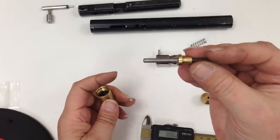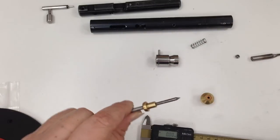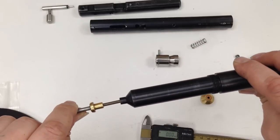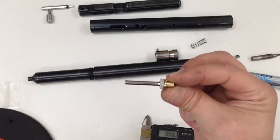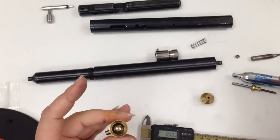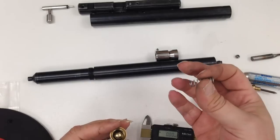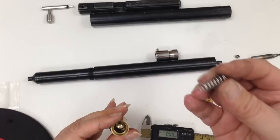I left this alone, but I made a new one of these, but without the needle that pierces the CO2 cartridge. It also kind of disturbed the high pack. So what I've done, I made this custom made valve stem with no needle. That fits in there nicely. I used the original spring from the boss valve. I tried lighter springs, but it just let out more air, less power. So I decided to keep this one because it was balanced just correctly.